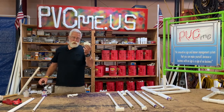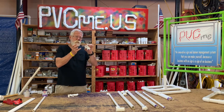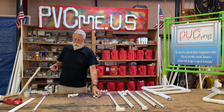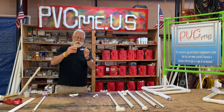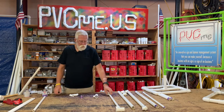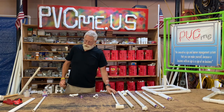On the fittings, you're going to use a one inch by one inch by one half. This is the part that swings on that top rod. You do not need to prime the one inch portion of this fitting because it is going to swing up there — it's not going to get primer or glue. The next piece is a zero piece. These little zero pieces in the half inch PVC are about an inch and a quarter long. They allow me to put two fittings together without a gap, which allows me to build these sign frames.